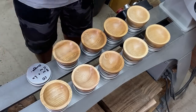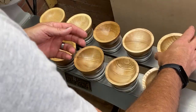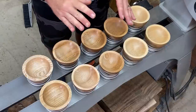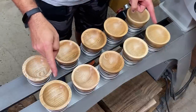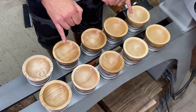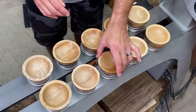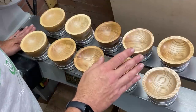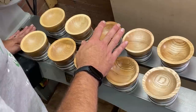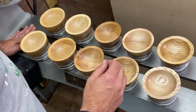Now these two, when I first put it on, there was a very, very faint smell. But I think in order to get the aroma through, the quantity needs to be increased. First impressions when putting them on, the wax made with the mineral oil seemed a little less firm than those made with the linseed oil. In all cases, apart from the sloppy microcrystalline wax, which is that one, everything was actually firmer than I would have probably liked it. So going forward, if I was to make these up again, I would increase the amount of base oil and obviously decrease the amount of wax used. So if you're going to try this, please try with less quantities than I used.